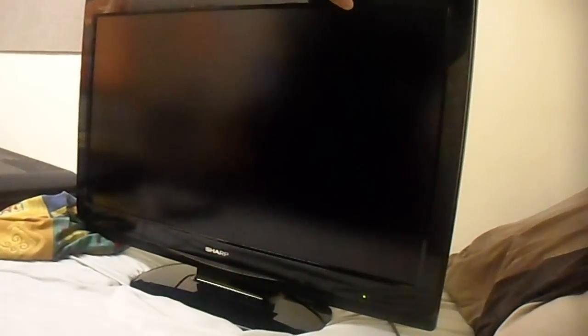Since I've applied the fix the TV will work and it will show snow on the screen. You know you're in service default mode when you see the 'K' on the side of the screen. Then press volume down and channel down to access the service mode. Use the up arrow to move between pages, then channel minus and channel plus - you must use the remote to do this. Then go to Lamp Error Reset and press OK, then Lamp Error Stop.